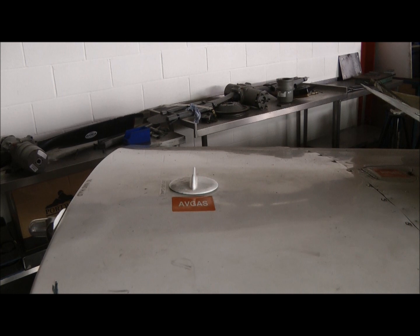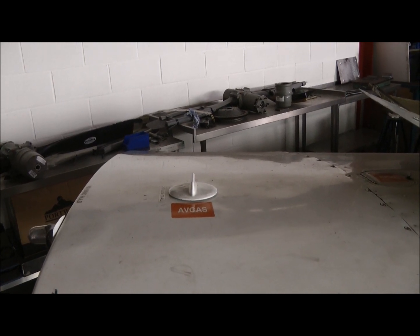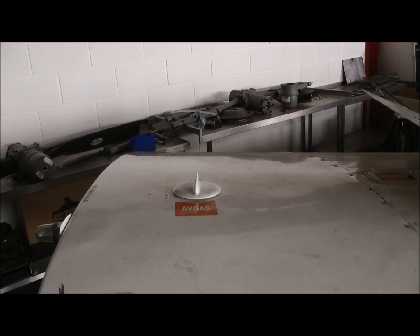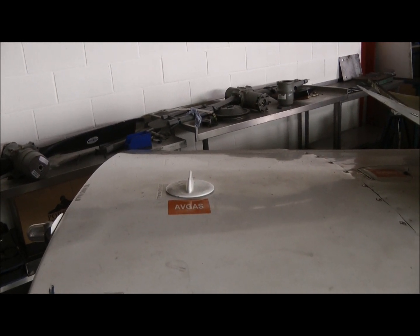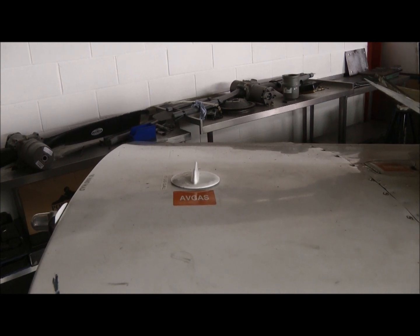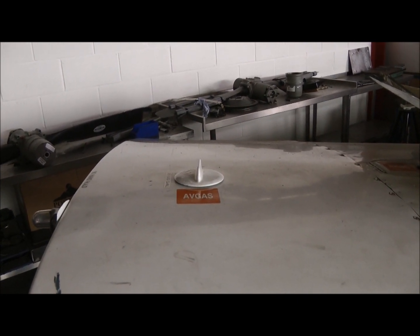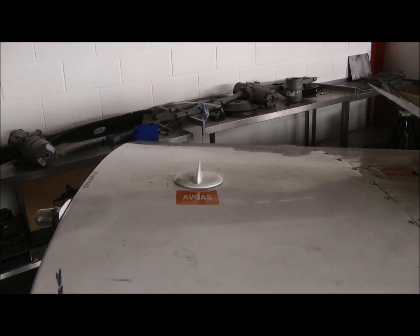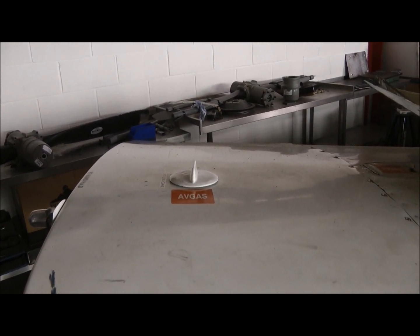To increase the range, the Piper Aztec has 3 separate wing tanks. And here's the wingtip tank, the smallest, which is used probably the first, so that the weight of the fuel ends up being concentrated nearer the centre of mass of the plane, which helps the handling.